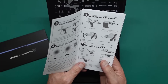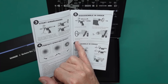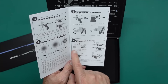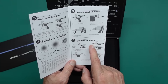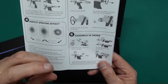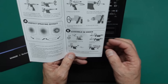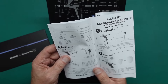The manual covers disassembly: remove the handle, loosen the needle chucking, pull the needle from the back, remove the air cap and nozzle cap, then remove the nozzle. Hopefully the nozzle will come out with the nozzle cap. Reassemble in the same order. Importantly, if your nozzle cap won't go down flush, don't try to tighten it — you'll damage the nozzle. Make sure the nozzle is seated centrally in the nozzle cap first, then tighten so everything is flush. Push the needle in gently until it stops, tighten the lock nut, and add the tail part.